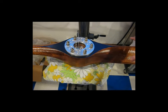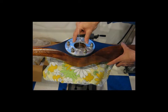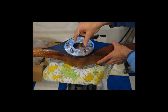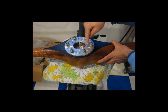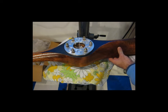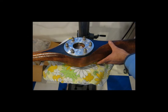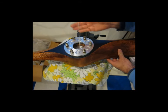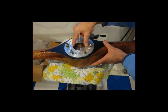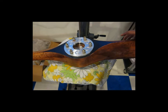The next thing I have to do is get underneath the propeller and make sure that the bubble level is oriented in line with the blades. I can swing the table out of the way so I can see underneath at the bubble level. Looking underneath, I'll have to turn the bubble level so that it's in alignment with the two propeller bolts as a reference. You want the bubble level aligned with the propeller blades, and not going across the blades.